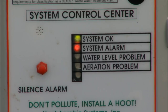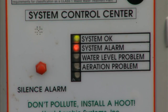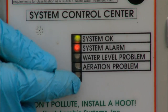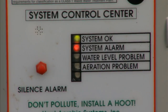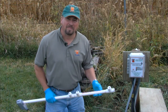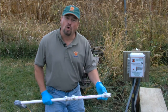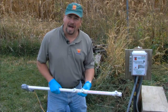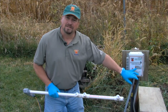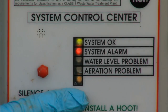Mode one gives the status on the system and tells us the water level in the tank, displayed on the front. We have a red system alarm light indicating we're in service modes, a green light indicating ambient light, and three bottom lamps that indicate the water level the probe sees. When it sees water over the low probe, the bottom light will light; over the high probe, the middle light; and over the alarm probe, the third yellow light. We exit mode one with the probe indicating water over the low probe.